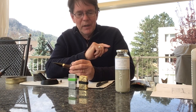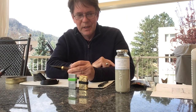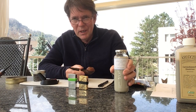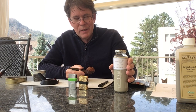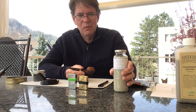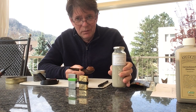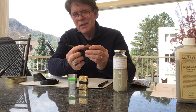There's only one caveat, and Rolf in his German video pointed this out. Don't use the concentrate, and be careful on the dilution. I did 2-to-1 because they said for wood surfaces, you know, that would be about right. But I noticed even this 2-to-1 solution here will darken only to about exactly this color.